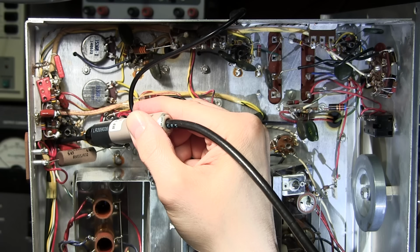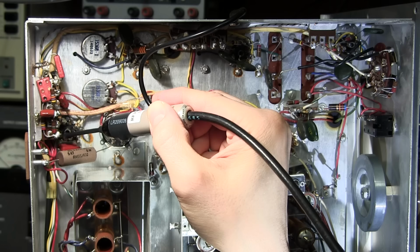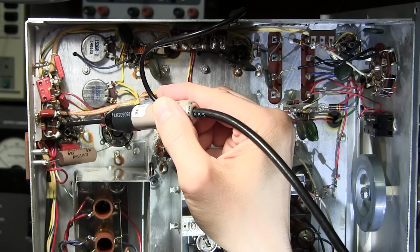Now, one thing when you're looking for a noise like this, not to get that confused with that rushing noise in the background, that's just a sign that the IF is working. So this loud noise, we don't want to get the noise confused with that. We want to just listen for the crackling. And there's a mixture of it right in here. Hear that?